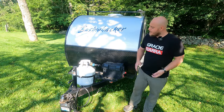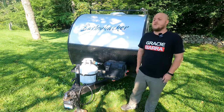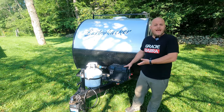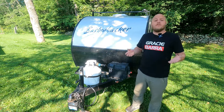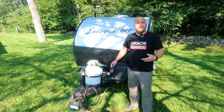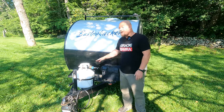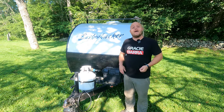Now for the solutions. Maximize your capacity as per your needs — do you need 100 amp hours or 200 amp hours? Go with the biggest set of AGM you can handle. You can buy large 110 amp hour batteries and put them in parallel to add capacity, or go with a golf cart battery at 225 amp hours wired in series. I know someone with two of those wired in parallel — that's 450 amp hours of AGM capacity. Make sure you understand your size and weight restrictions and go up to that point.